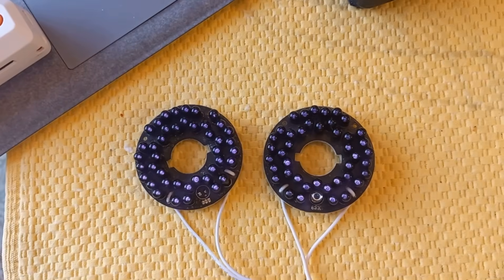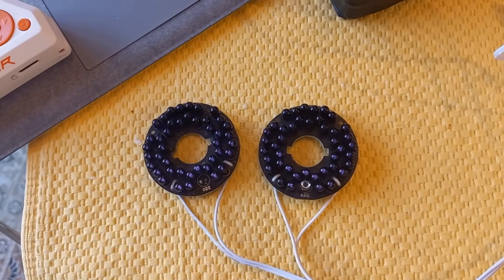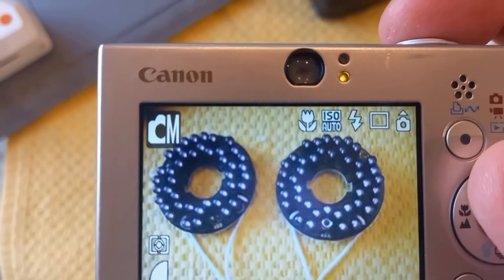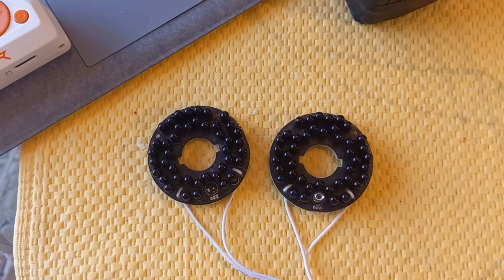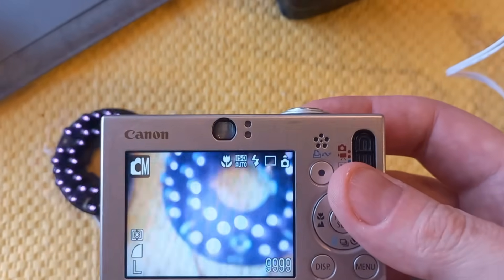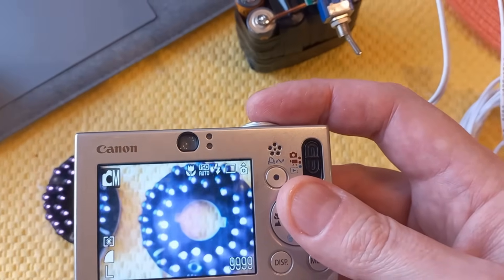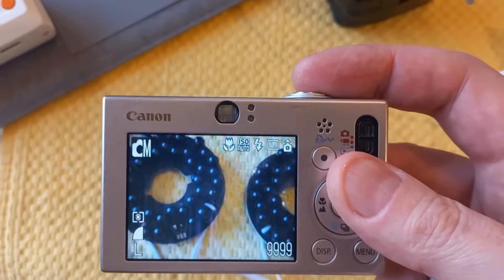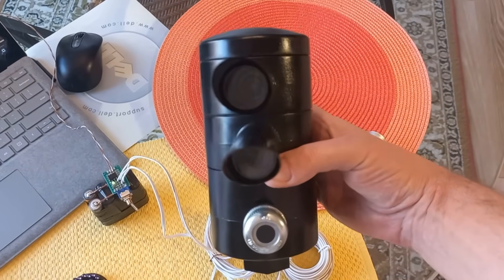Today I actually hooked two of them up to make it a bit more exciting — having two would be really beneficial. I'm going to show you: focus on that, and you can see the phone has an infrared filter so it doesn't really pick those up very well, but this camera does not. You can see how much brighter it is in the infrared spectrum. That 14 hertz pulsing from the LEDs is picked up by one of these OptiCom sensors up on a traffic light system.